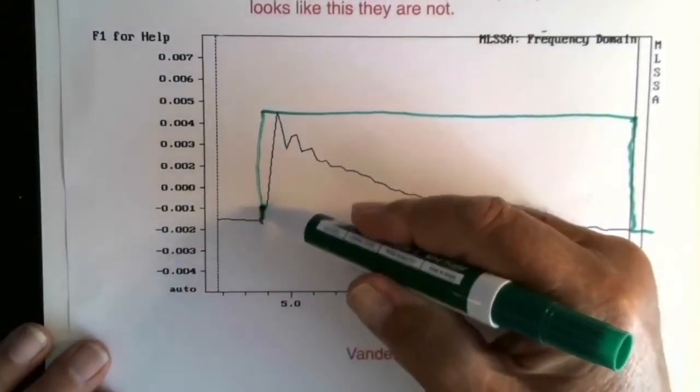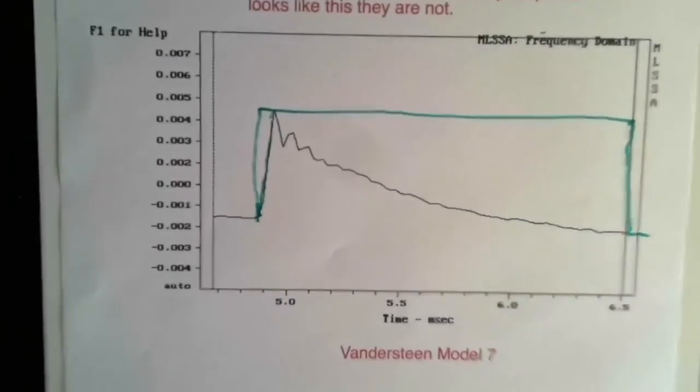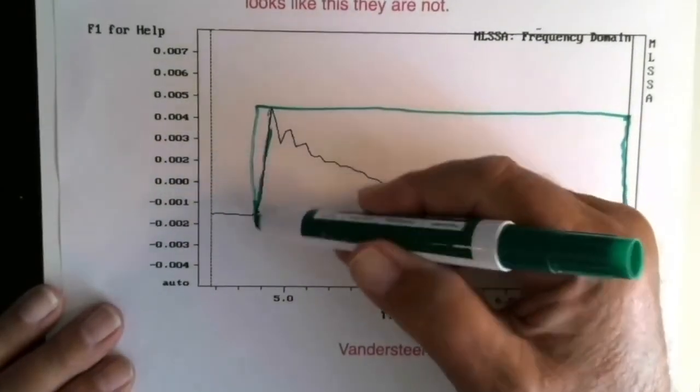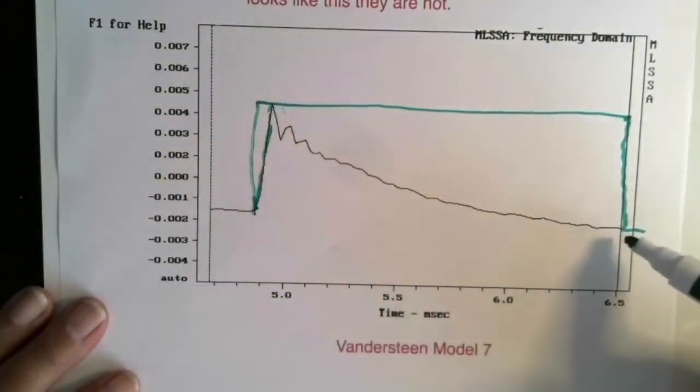The reason the line leans here is because that speaker doesn't go up to the megahertz in frequency response. Because it has some point where it rolls off, you get this slight lean to it. Then as it goes down here, we'll see to the end where the test ends. Now I'll draw how this happens on, in this case, a three-way. So here is the input.